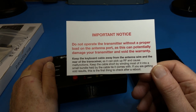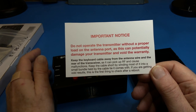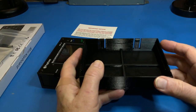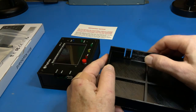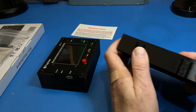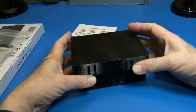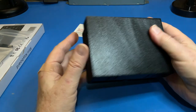A strong RF in the keyboard cable can overload the RF filter on the keyboard input to the transceiver. This is the lid of the unit, which has two flexible fingers on the front and two on the side, which hold the lid in place. To put the lid on, position the two fingers towards you and place over the unit with the power switch towards you. The lid protects the LCD and LEDs when not in use from damage.